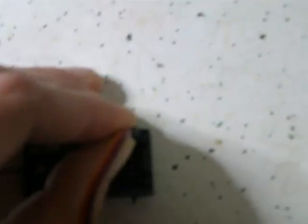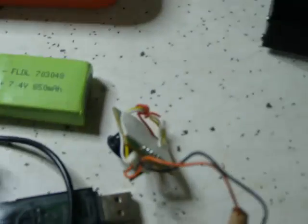Basically we just plug in, and then we plug in our cable, and then we give our receiver power. There are a few different ways you can do that — you could take 5 volts from the USB. At the moment I'm just using a little 2 cell battery with an old receiver board from an eSky that's got a little L7805 voltage regulator on there, so I'm just using that to power the receiver.